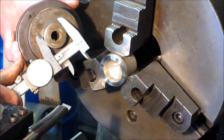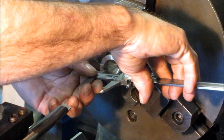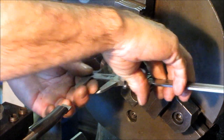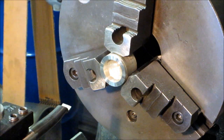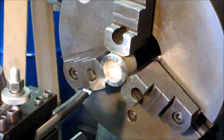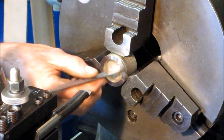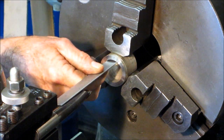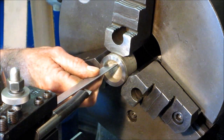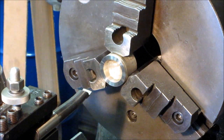We are extremely close — this is like one and five-sixteenths on the OD. With the calipers here we got like 282, 283. So we're going to take a light skim and then go get a small pair of snap gauges to read that. We have a little over a half inch, maybe nine-sixteenths that has to go in. We're going to be modifying the depth of that drill point in the bottom — it's like 450 — so we've got a little bit of plunging to do.